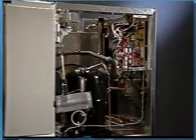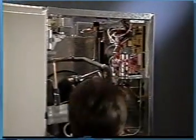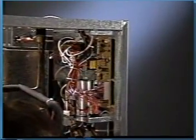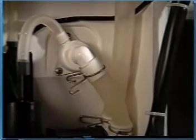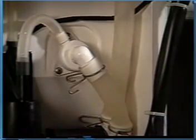If all components are operating correctly, allow the unit to operate in the ice-making mode for about 6 minutes and then disconnect the float switch at the circuit board. This initiates the harvest cycle. Check for correct pump-out operation by watching water flow through the clear tubing or out the unit drain.